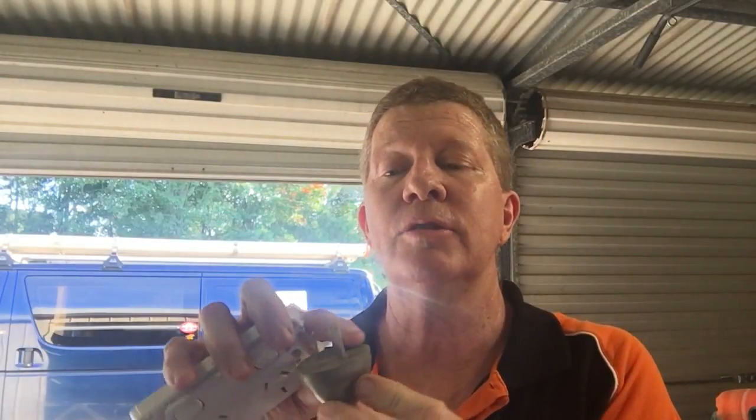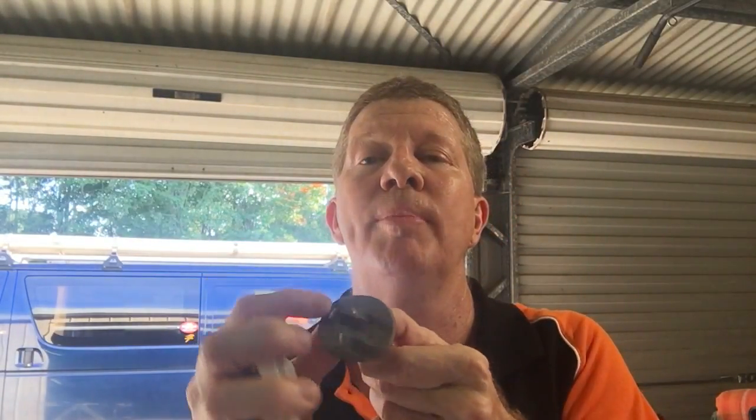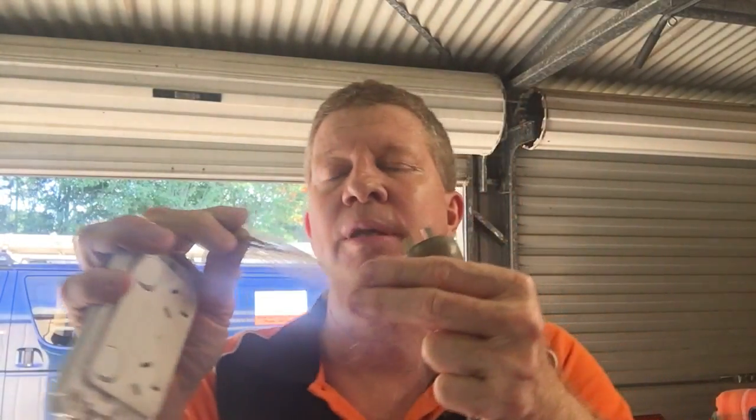Now there's a couple of different ways for dust and lint to build up. If you've got it permanently plugged in, dust will work its way down inside there. So every time you come around and unplug it, it's a good idea to wipe around here, so that there's no dust on the plug, and wipe across there so there's no dust to short across. Because you might have cat hairs, this is a little bit of hemp as an example, but the same sort of fluff that you get out of your dryer, it's really light sort of stuff, light dust.